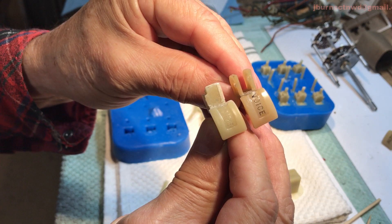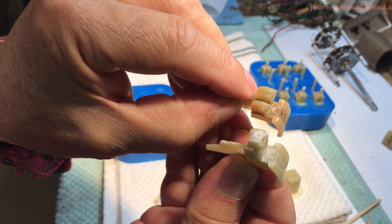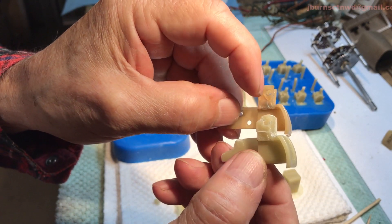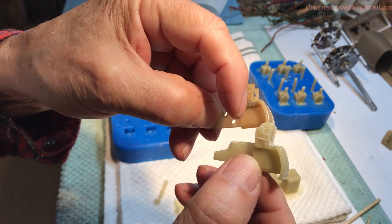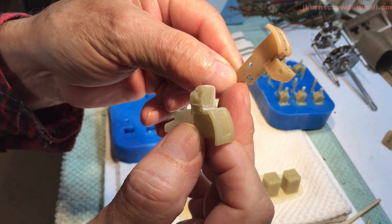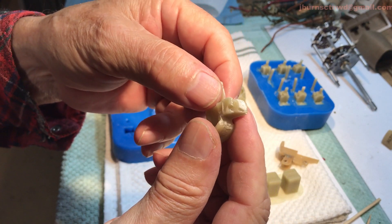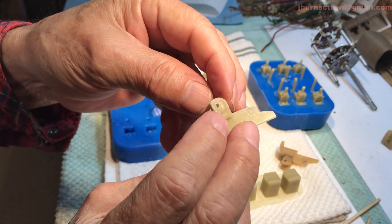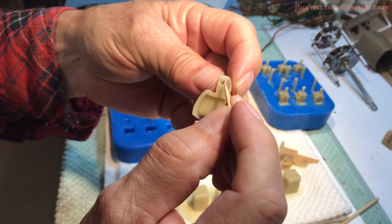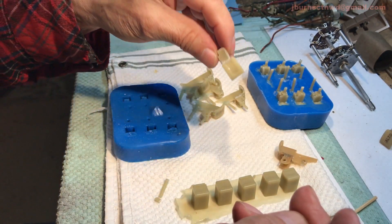Here's the original one, here's the new reproduced one. I still need to punch the hole — I'm going to leave the other hole that's not used solid, and drill the hole that's going to be used for this particular button. It looks like this one out here on the edge is going to get drilled and riveted or eyeleted, and then I'll shoot the hole through once I get the locations. I've got them pretty much cast in there, so I can drill right through that reliably.